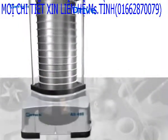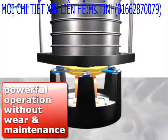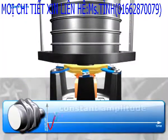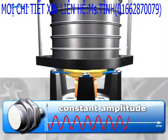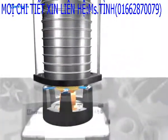As the sieve mesh is the core of the A450 Control, the engineers selected the components with great care. The three-layer leaf springs made of fiberglass ensure powerful operation without wear and maintenance. A highly sensitive and precise inductive displacement sensor keeps the selected amplitude constant over the entire sieving process, with heavy loads of up to 25 kilograms.